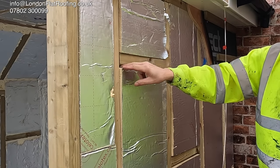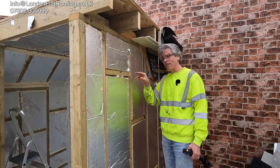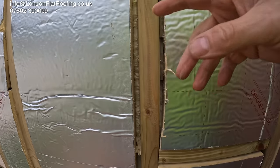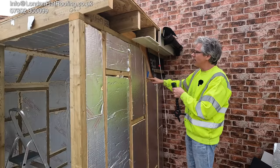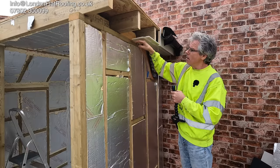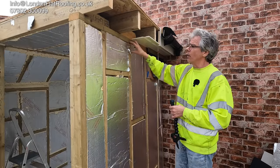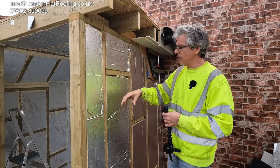If we look at this, you can just see how badly the insulation fits on this side. Generally when someone's cutting this in, they'd cut it at a slight angle so that it fits tight on one side and not on the other. Using this camera you can see the foam is not coming right the way through, so your performance is pitiful in certain places here. And even here — you couldn't see this from the other side — there's a gap that runs right the way through. I can see daylight through that gap. I can see daylight up here as well. Looking at the way that the stud work's done, there's a massive gap just there which is going to give heat loss. When I show you this on the thermal imaging camera, keep your eye on this area — you can see this is glowing red, showing loads and loads of heat loss. Up here at this joint — loads of heat loss. Loads of heat loss in that area. You'll see a shadow there; that's my shadow because of the reflection of me when I'm doing it with the thermal imaging camera.